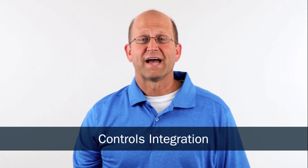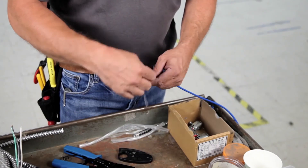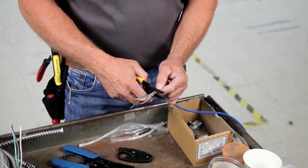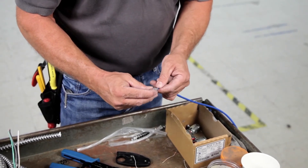Energy legislation is driving high usage of lighting controls. In this application, we are using an in-line network control solution from Acuity Brands. Each fixture is embedded with a switching and dimming control device that is fed with a Cat5E cable. Even if these cables are ordered pre-terminated, this is a second set of labor normally done sometime after the line voltage installation. If it is field-wired, this is a very labor-intensive effort as there are eight tiny wires to strip and terminate. Missed wires or poor terminations can lead to hours of troubleshooting.